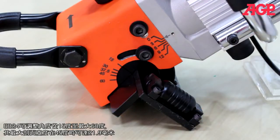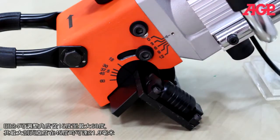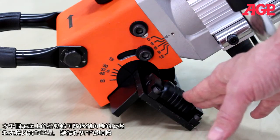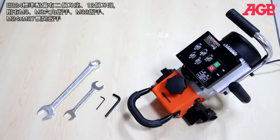The model EB24 has angular adjustment from 15 to 60 degrees with a maximum land width of 21.9 millimeters at 45 degrees. The table plate rollers relieve sliding friction and support the weight of the machine for smooth operation. The EB24 comes complete with the two milling discs and 12 inserts installed, as well as M3 and M8 L hex wrenches.